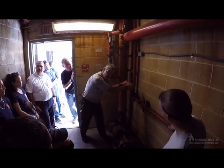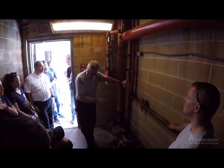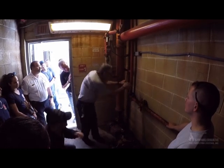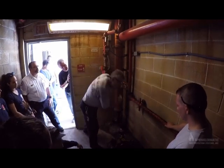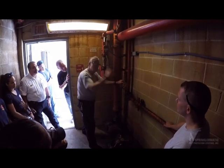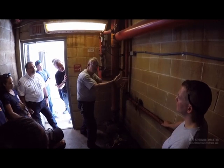Be careful flushing this. If you have a company already flowing water, which would be highly unlikely, if you crank this all the way open, you stole their pressure. Additionally, once you make the connection, if we open this valve before we charge the lines, the water feeds back through the pump and we drop the pressure.